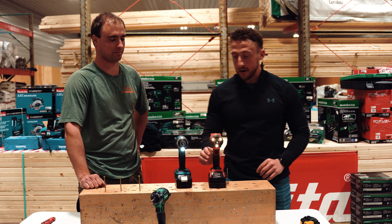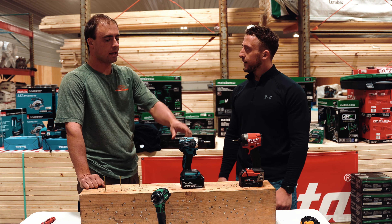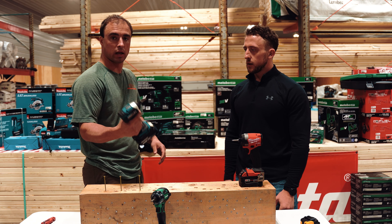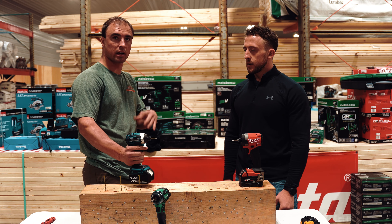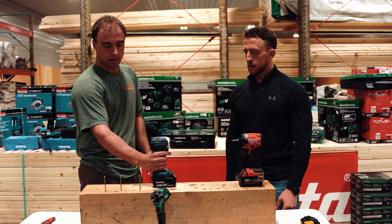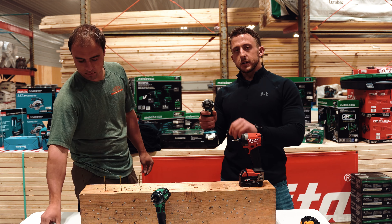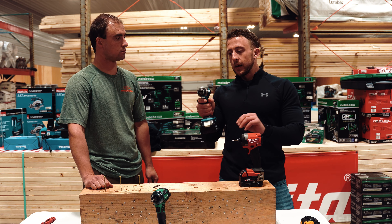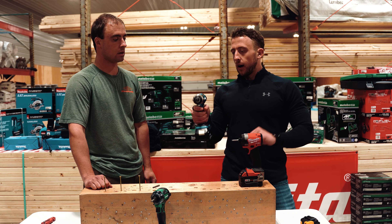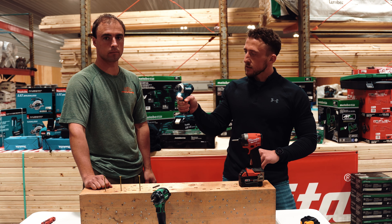Milwaukee is a powerhouse. But Keith, what drill is your favorite? What do you like about the Milwaukee? We have a lot more experience with the Makita versus the Milwaukee. One thing I do like about the Makita is when you're adjusting screws that need to be precise — like roof metal — it's really important that you set the depth correctly. The Makita is just a little easier to control the depth versus the Milwaukee, especially on the gable trim and eave trim, making sure the screws are not over-sunk and creating buckling in the trim. The Makita is way easier to fine-tune that speed.